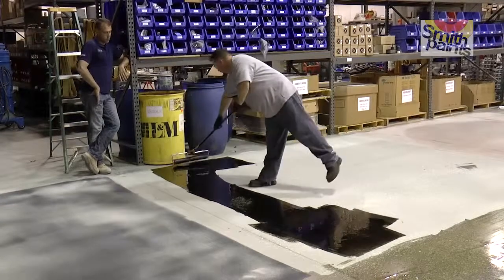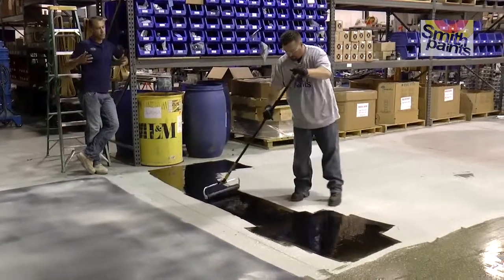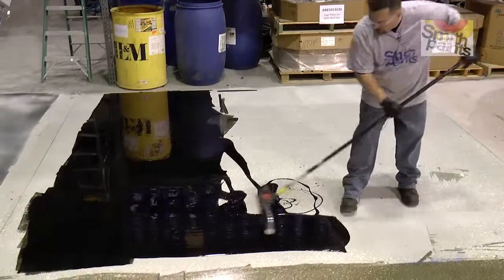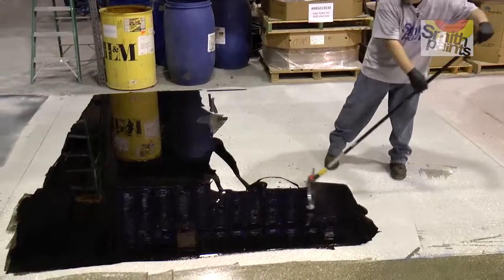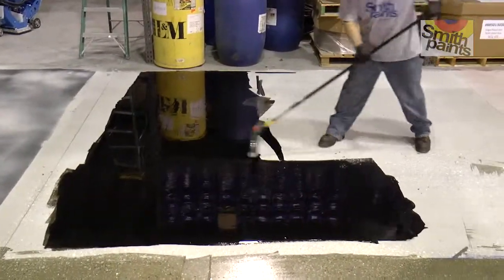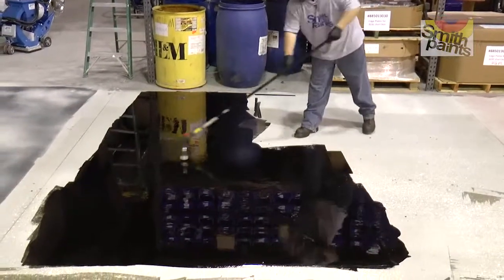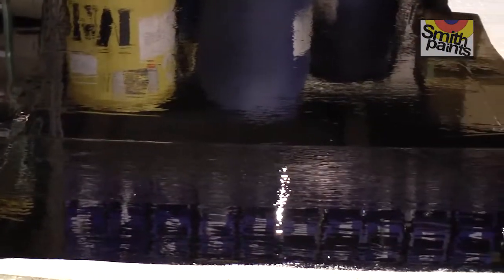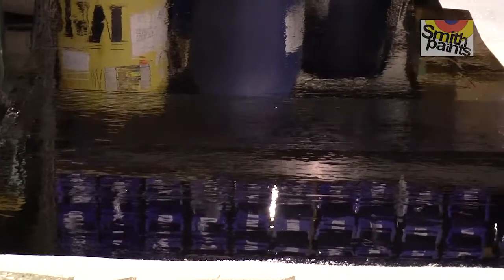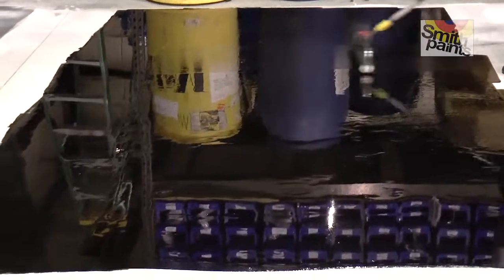Especially floors that have a lot of imperfections that you don't want to have smile through the floor — you want to eliminate those. We're putting this down somewhere around 320 square feet per gallon on the light side, upward of 160 square feet per gallon depending on the floor. This can be applied either with a notch squeegee and then back rolled to break the surface tension, or you can pour out a ribbon and use a flat squeegee, or just dip and roll it like this. Pull out any low spots where it's puddling so that it's a uniform base.